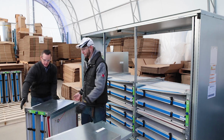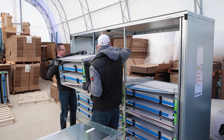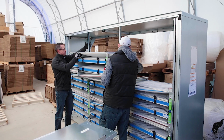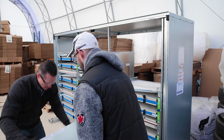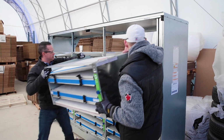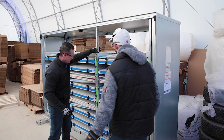Posts are provided and are fabricated to the specifics of the air handling unit. Module width is chosen to minimize the overall number of modules and keep them the same width in each air handling unit. This simplifies media replacement and ordering.